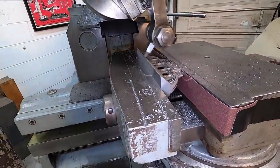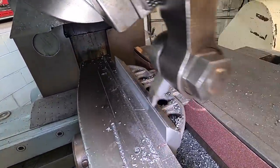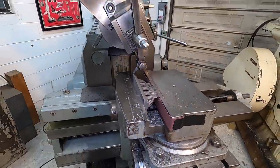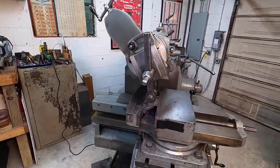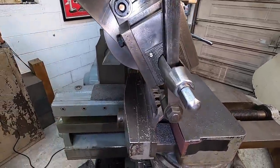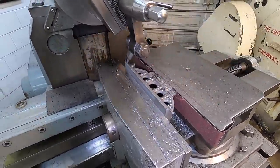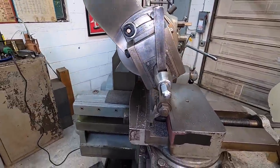There's our freshly ground tool bit doing a good job again. The problem with machining these castings is trying to get through that scale on cuts like this — you're not actually getting through the scale on the first pass because we're trying to clean up that top edge, so you might hit a little chilled spot on there that dulls the tool bit in an instant.